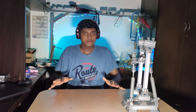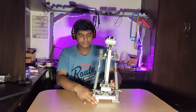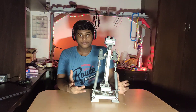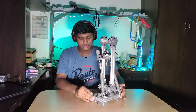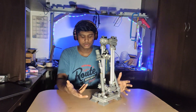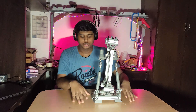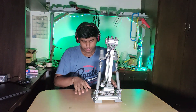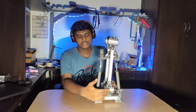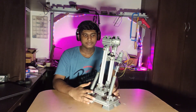I'm done with the first part. It consists of this mechanism right here. The first basic piece is the base part, which is responsible for handling the entire load, so it needs to be well distributed. I have four pieces which distribute the load evenly. The second part is this universal joint right here — this trunk — which helps the aluminum skeleton of the robot move freely in all directions.